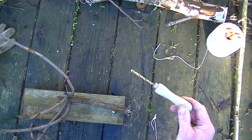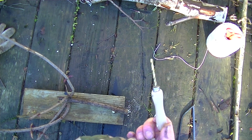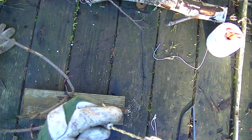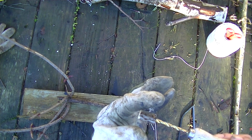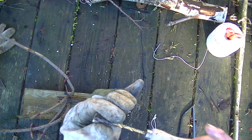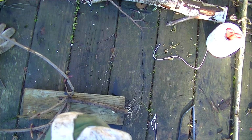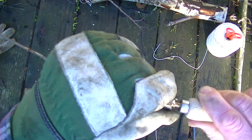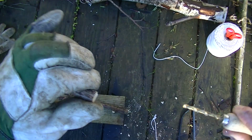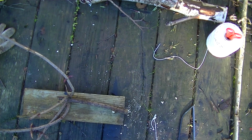Now, at school, or in the woods, we would keep our glove on and we would use one of these, and this is called a palm drill. Okay, really useful tool for lots of things. The only reason we use it is it's about the right size. You can put it here. I don't mind people doing this in mid-air, if you like, holding it with finger and thumb, and just twisting slowly. And what happens is, quite quickly, you go through, okay, and then I just pull it backwards and forwards a few times, and you end up with a lovely tubular hole in that, okay.